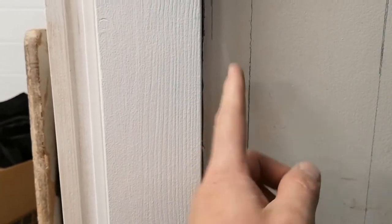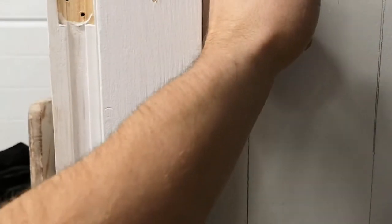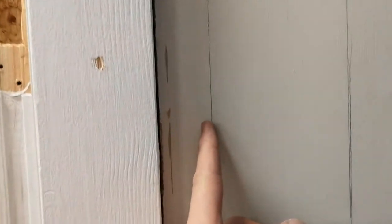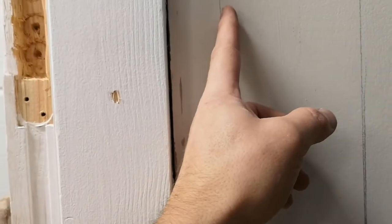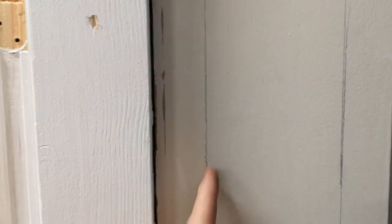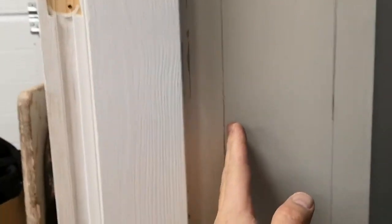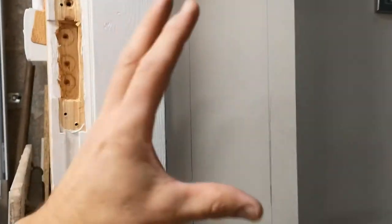What I'm going to do is set back the door frame - move it back 20 to 25mm. I'm going to cut the plasterboard all the way down using the same process as separating the door frame: run my knife down there first, then get the drywall saw to follow that line, and then simply move the whole door frame back to butt up to that new line.